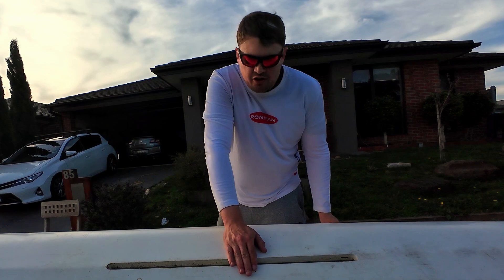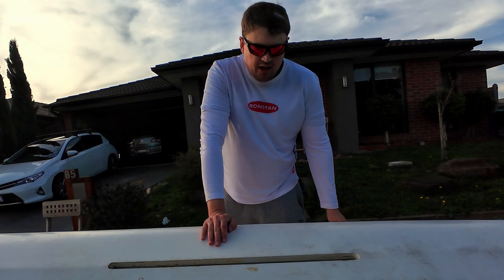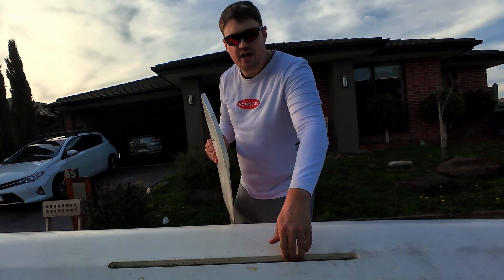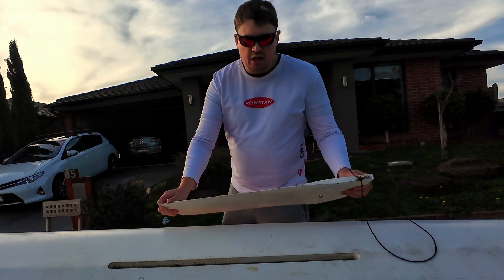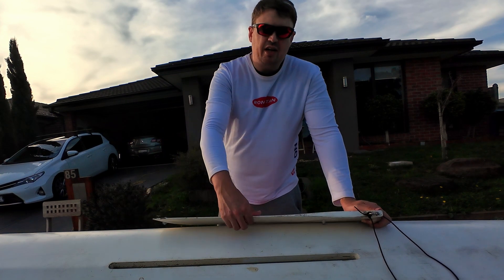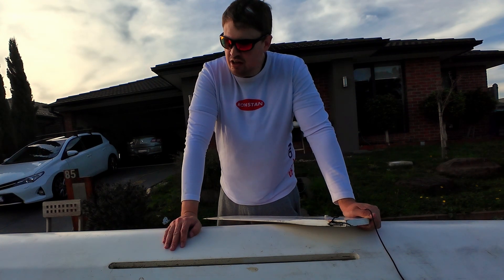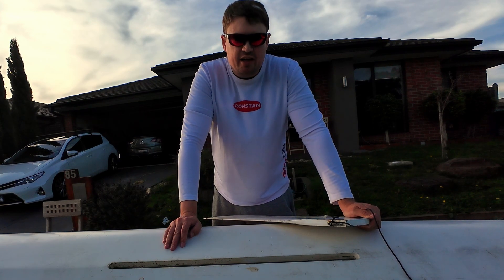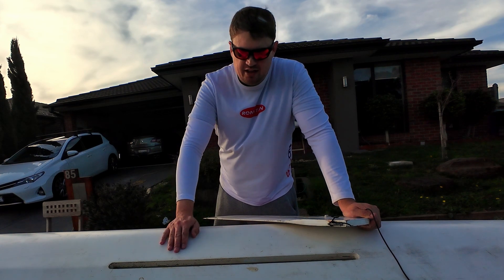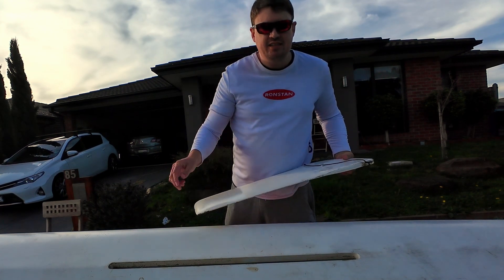Aaron on Sailing Anarchy, who's got the other one, said the same thing happened to his. When you try and stand on it to ride it — someone's probably done that in the past 40 years — it smashes the side of the centreboard pin through the case because it's supported about halfway up, not at the top. I see this as two options. One would be to cut a hole in the deck and try to repair what's there and maybe reinforce it. Aaron added a bit of plastic to the top of his centreboard so it pulls up flush on the deck. But in the five minutes I got to sail this boat before it sunk, you could tell the centreboard is really small for going around a track. I believe this boat was more intended to just go for a burn off the beach. If you're going to try and hold it in a pre-start or sail around a course in light air on a lake, the centreboard feels seriously small — that's the size of it, and when you think about how much gets lost in the case, it's tiny.